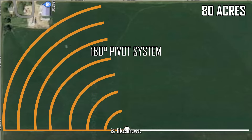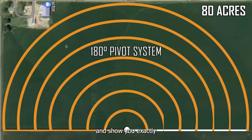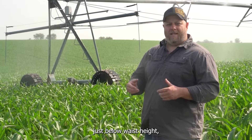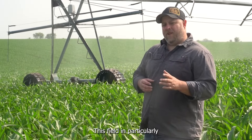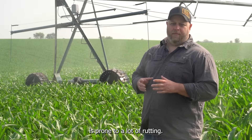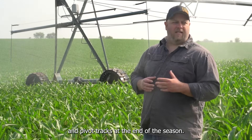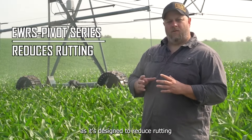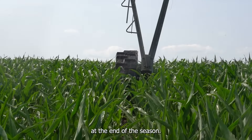We'll show you what the rutting is like now, and then we're going to follow this set of tires through the season and show you exactly how they're performing as the season progresses. We're at a stage where the corn is just below waist height, and it's really about to start using a lot of water. This field in particular is prone to a lot of rutting — the customer will generally have really deep pivot ruts and tracks at the end of the season. The EWRS pivot tire is intended to help with that, as it's designed to reduce rutting and increase flotation so that you don't have those big tracks at the end of the season.